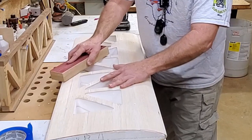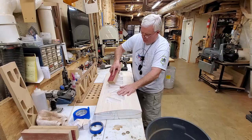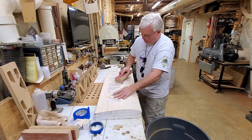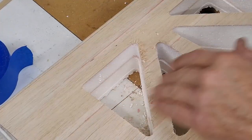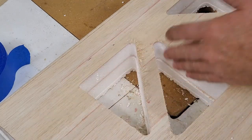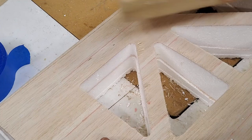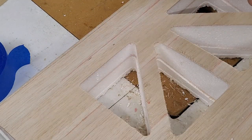And I try to drag. Don't be tempted to go down in there. You don't want to do that, because you'll sand that edge too much. But those fuzzies will sand right off the top very easily. And you just kind of comb them up like that. If they're hanging down inside, usually they are already hanging up. But if they're hanging down inside, just comb them up a little bit and drag right across the top. And after 2 or 3 passes, again, staying level,